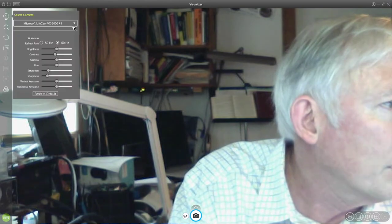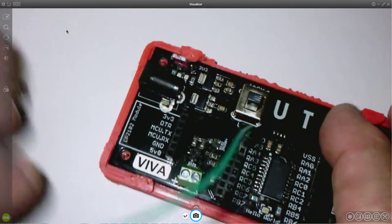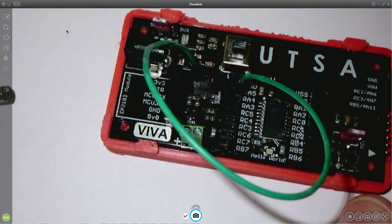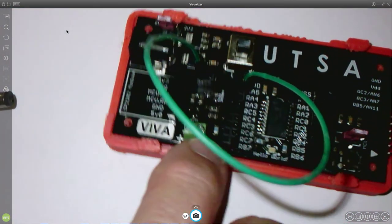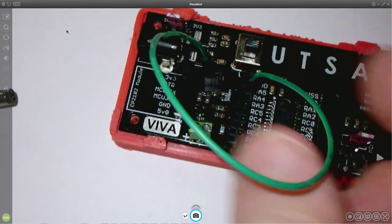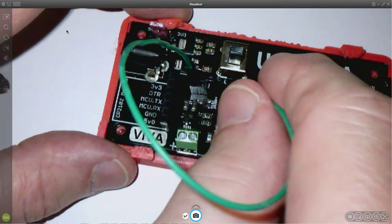For instance, let's say you were going to use RA4. So here's RA4 — plug this in, and then you just plug this right into the two terminal. You plug the green wire into RA4, and then you plug the other one in here to the two terminal — either terminal will be fine because they're exactly the same. Whenever this is high, it'll put nine volts out here if you're driving it with a nine-volt battery. When it's low, it'll put out zero.